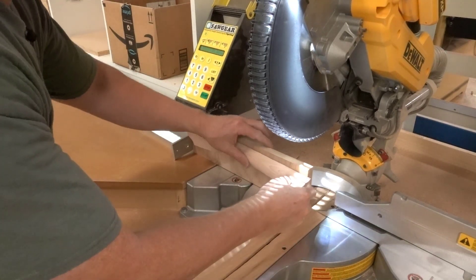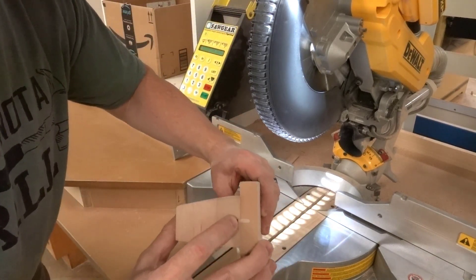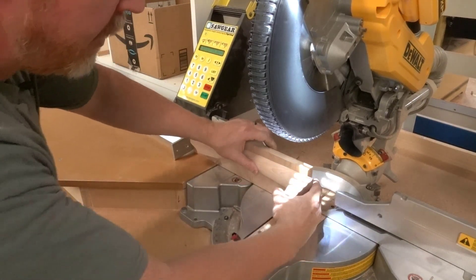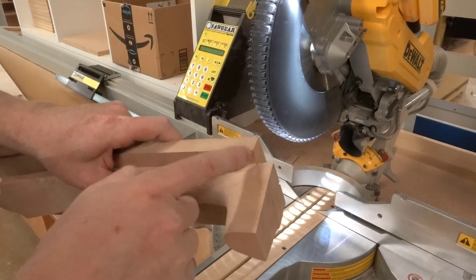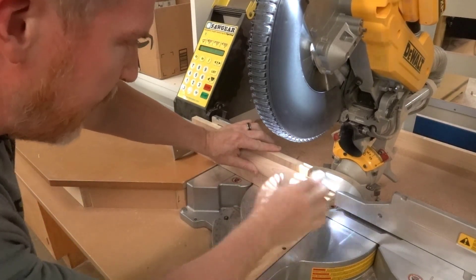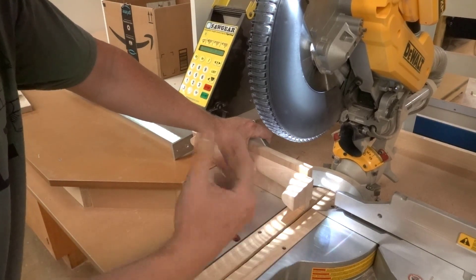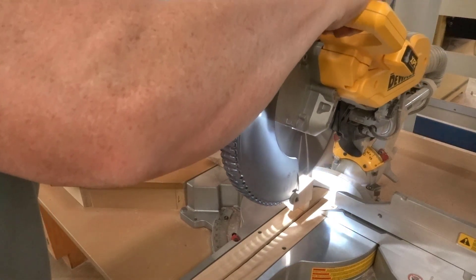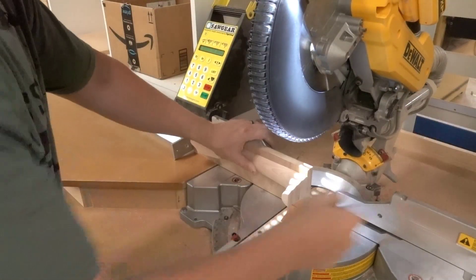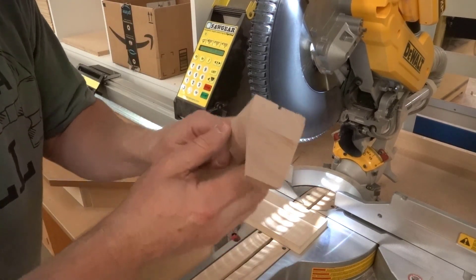All I do is put the neck in that jig and it fits right into that slot. All the way back. Now I move it so the pencil line is extended just beyond the edge of the board — the blade is going to cut that off. I want that perfectly lined up with that pencil. That's lined up. I hold it nice and tight and cut slowly because there's nothing underneath to prevent tear-out, so the slower you cut the better. As you can see, there's just a little bit of tear-out that just wipes away with my hand, so cutting slow did a good job.